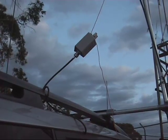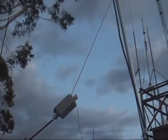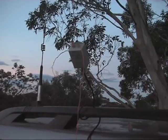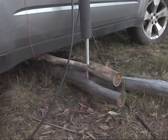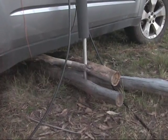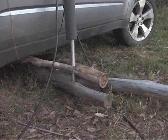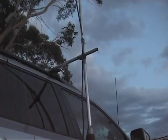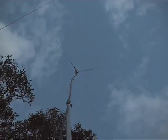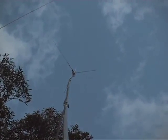I'm running a half-wave end-fed for 80 metres. Here's another look at the balun. I'm using this to support the UHF mast, which is 7.2 metres tall, next to the car. On top we've got a diamond vertical, which covers 6 metres, 2 metres, and 70 centimetres.